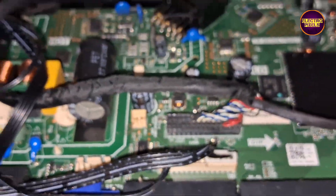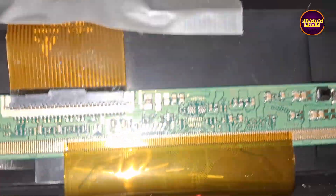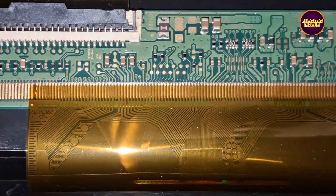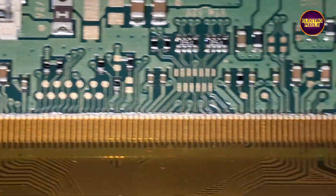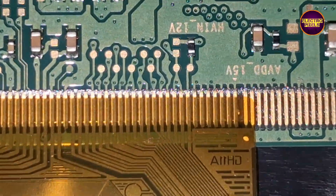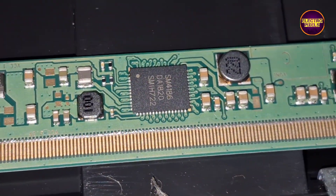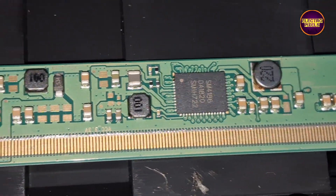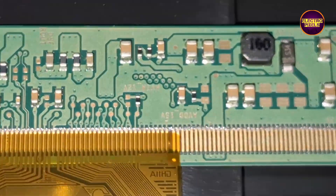The complaint is with the TV display. These types of complaints are mainly due to internal shorting and gate signals inside the glass panel. The shorting may be from either the right or left side of the glass panel. This TV comes with a single COF Samsung panel with an SM4186 DC-DC IC. Due to internal shorting and gate signal issues, the panel DC-DC IC goes into protection mode and doesn't generate basic panel voltages like VGH and VGL.